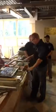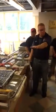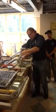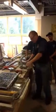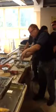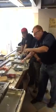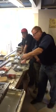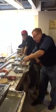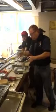The third is our hand cutter. Hand cutter, again, you don't always need to have the wet saw. With the hand cutter, this basically scores the tile, and then you push down and you snap the tile. So you take it back if you want to move in, get a little closer look. You get your cut, you push down, and there's a blade in the front of it. And this will basically scratch the tile. If you do one pass and you don't think it's sufficient, you come back and do another pass, keeping it in place. You can hear it, then you come back and press down. And you have your cuts.